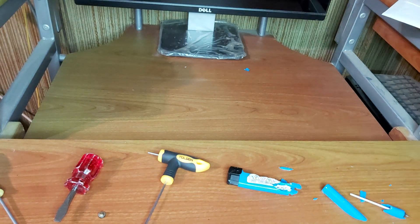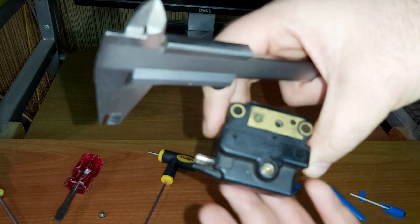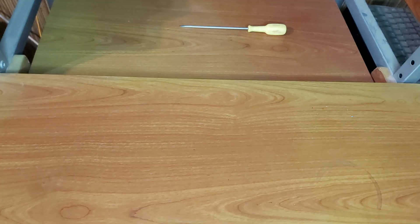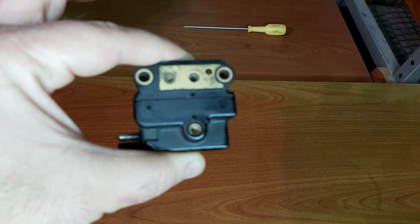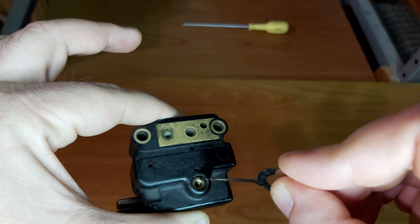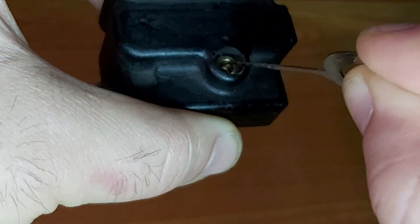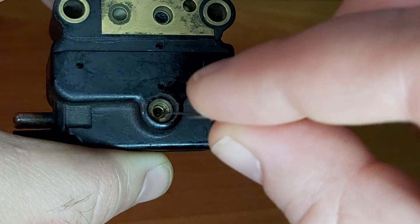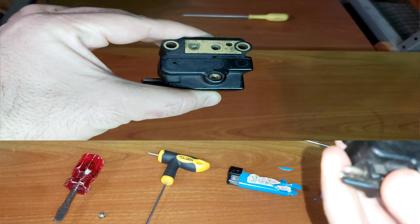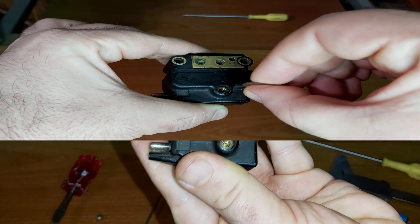One more thing — some of you have been asking me how do I measure the depth with the caliper, where do I start measuring from. So look: your caliper must hit inside. You don't measure the distance between the thread and here — the screw. You hit it all the way inside. Look, once again: not this thing, but there, inside — here, inside, this is what you measure. And you simply take a caliper just like this and you stick it in all the way in.